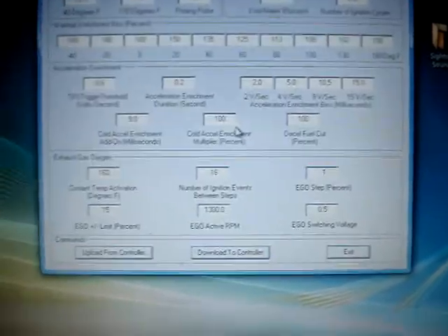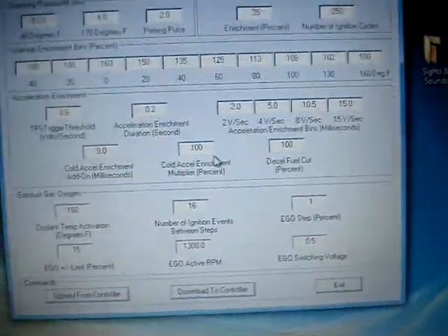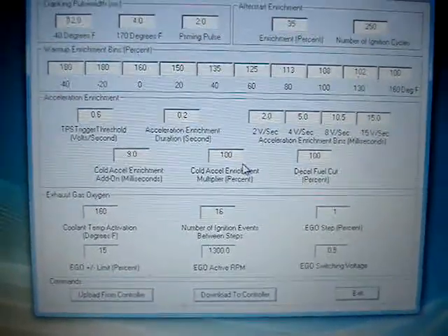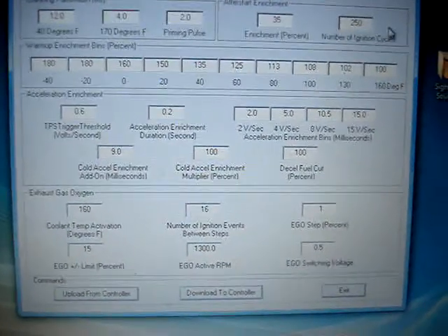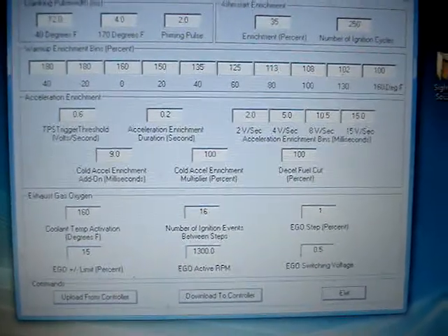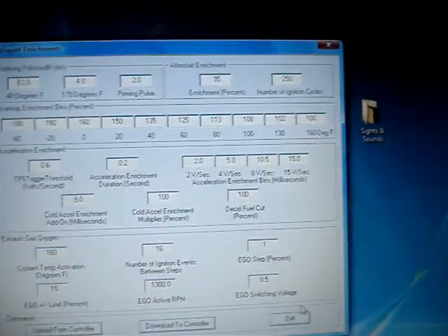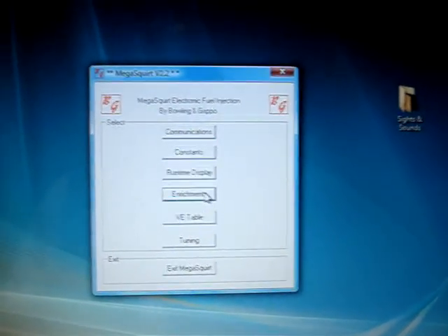There's just one of the fuel tables there. The next step after those tests will be putting a tune port on it and getting rid of the throttle body. It's a lot easier to control eight injectors instead of two big ones — better fuel delivery — and I should be able to lean it out even more on cruise.